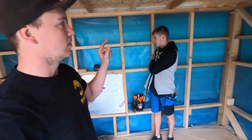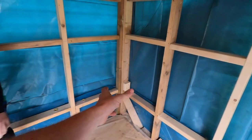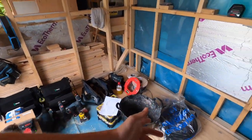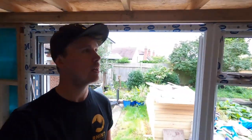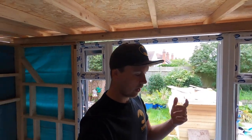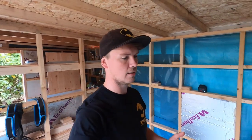I can't trust that they won't leave a gap around the cables when we put them in. The board's going to be going here and the cables going across for the sockets, up for the lights. The Celotex is all going to be stuffed into the ceiling, so I'm going to put it in some containment. The easiest option through here is obviously flexi-conduit — because Adam loves flexi-conduit. It's going to give that space, the barrier between the cable and the flexi-conduit, with some air running around it in the ducting itself, keeping the heat away from the cables as much as possible.